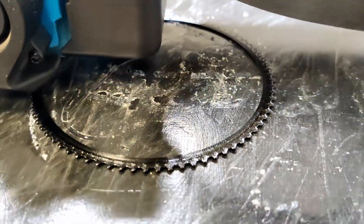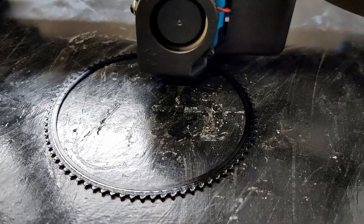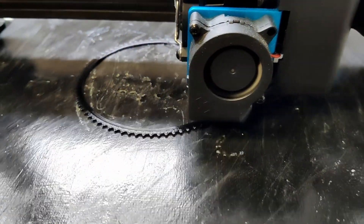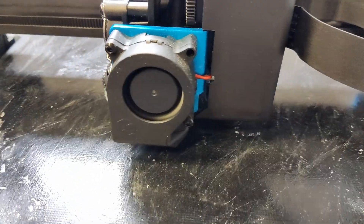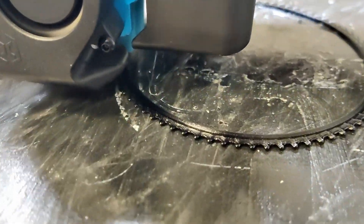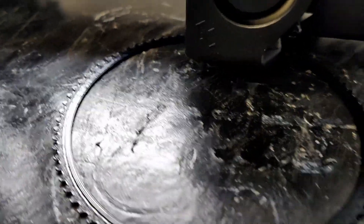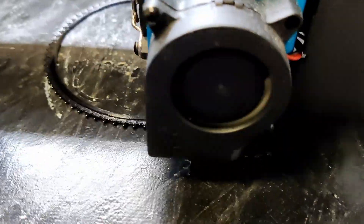Let's try 300% — 30mm per second. This is still slow from what I normally print at, but it seems to be okay. I'm going to leave this running for a little while and then come back, because that's when I should start to notice any issues, and I still have time to stop and restart back to my original settings. 25 seems okay, 30 again seems okay.